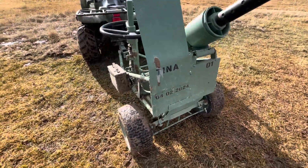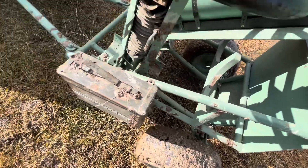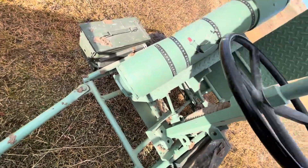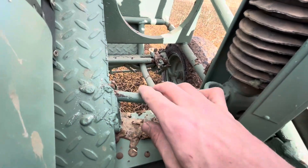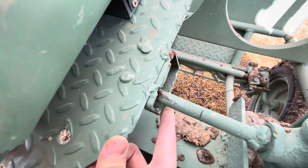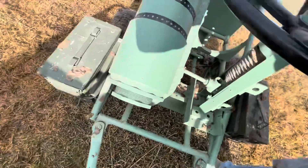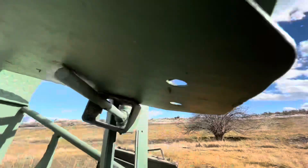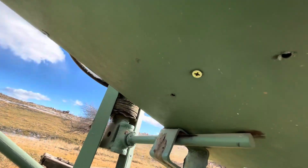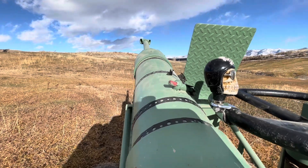It stays fine, it's stable, so I'm going to leave it as it is. It works good. I welded these pieces of metal onto the steering system so that it would be straight and stable. This elevation system, funnily enough, is a headgate opening system — like for a water irrigation system. I welded this T onto here so that I could put a rod that goes into a square tube I've got underneath the cannon. It's loose so that it can bounce a little bit and have some give when we're going down the road. But it works really good — you can see the square tubing is just a little bit of box tube. The rod goes in there and pushes up from a distance. It also gives you just a little bit of wiggle room when you want to aim — side to side, up and down.